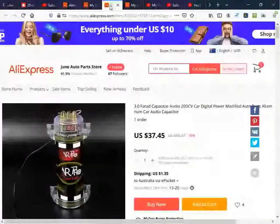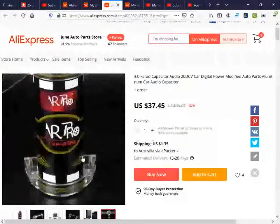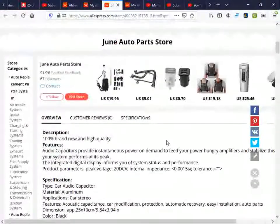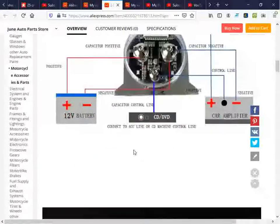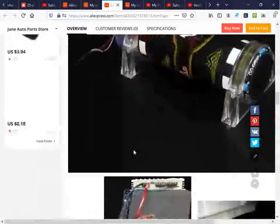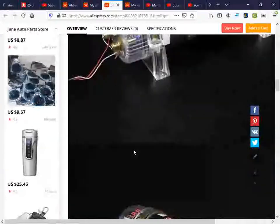And it turns out it's a fake. I really needed one, so here it is. It's rated at 3 farads, or about 3 million UF. The specifications are exactly what I needed — max of about 20 volts and very high power. But the problem is it's actually 170,000 UF, not 3 million UF.